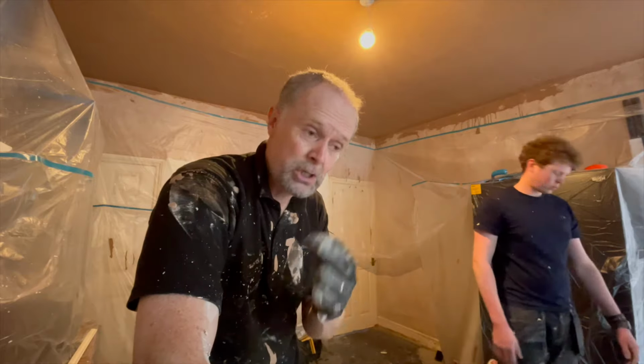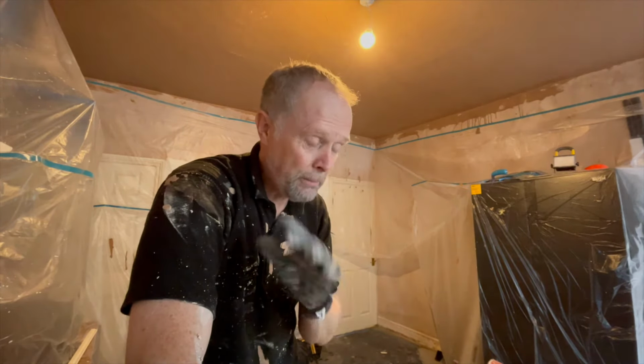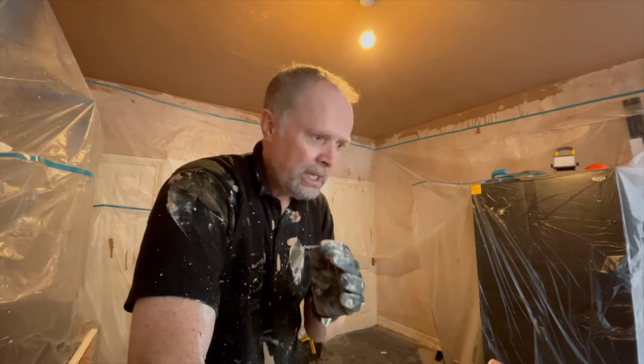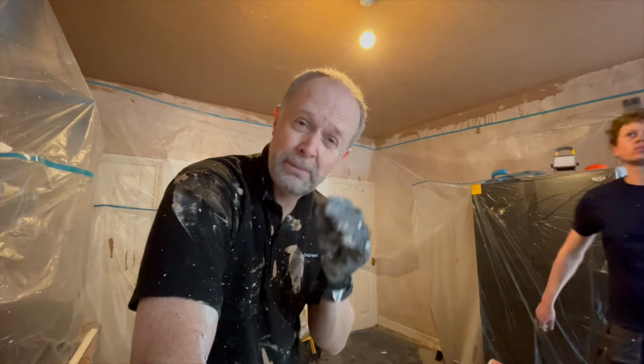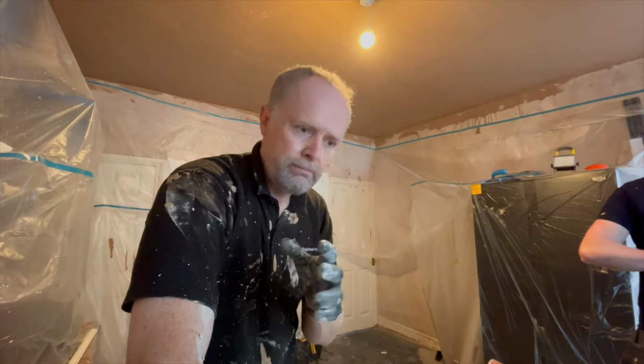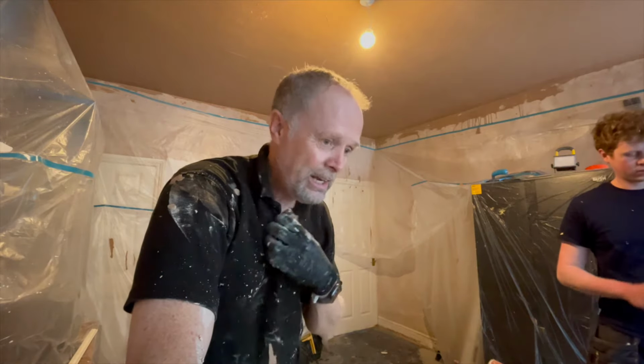It's rubbish, is SBR. Either the instructions are rubbish, or they should add some instructions. When you are on that thick paint that gave a swirly effect, where there's very little adhesion, I don't think you should water it down. It says three parts water to one part SBR. That is absolute rubbish. If you are doing it on something that's not very adhesive, I would probably put it in a pan, boil it down so it's even more concentrated, and then try applying it. Or just go for PVA, because PVA bloody well sticks and it works.